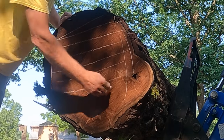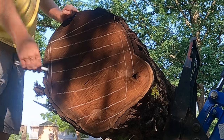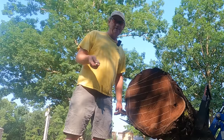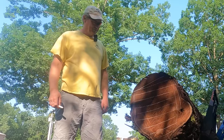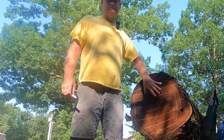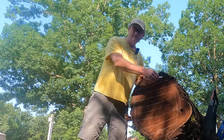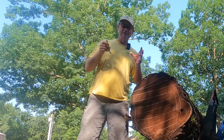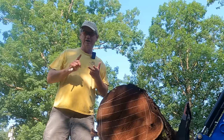I'm going to explain the pattern you don't use. It's what you see on a lot of YouTube videos — specifically some of the beginning videos. It's basically: take a log, skin a couple sides, and then just start wailing on it all the way through. The idea seemed to be that you center the pith in one board. Well, you're supposed to avoid the pith anyway — you don't include the pith in a board unless you expect it to crack, and that's not hard to figure out because it's already cracked.